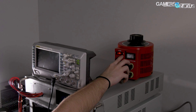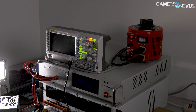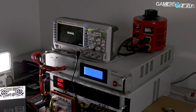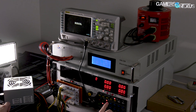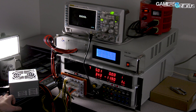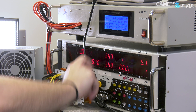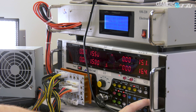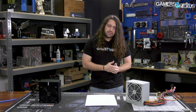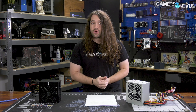We have enough data here to do some basics: efficiency testing at different loads using a load generator — the SunMoon 8800 — and a SunMoon 220 for measuring that load. We also have an O-scope for measuring ripple. We are using a new setup not included in this test for fan speed and noise testing for power supplies, which is a really difficult problem we've solved pretty well but won't be showing up here today. Instead of going through all the details now, we'll finish fan and noise testing and then make one video or article talking about the full testing methodology. But today, the basics: SM220, SM8800, O-scope, with more information in the article linked in the description.